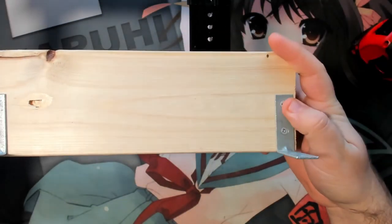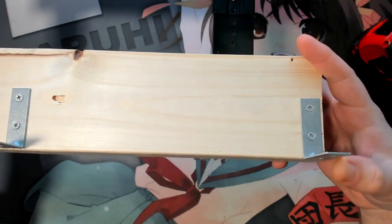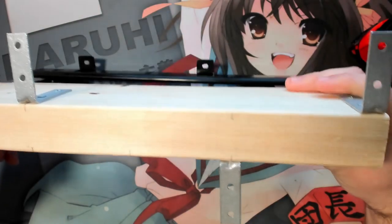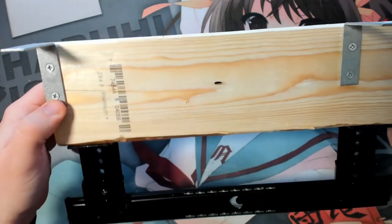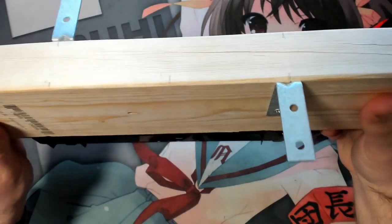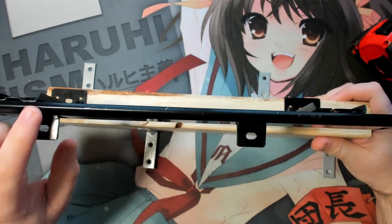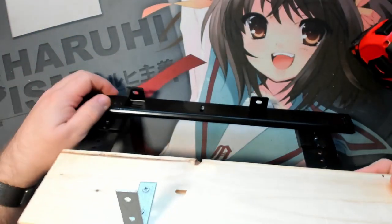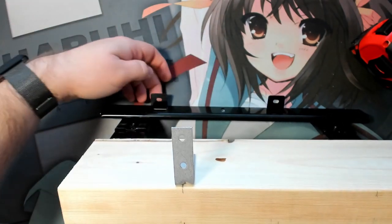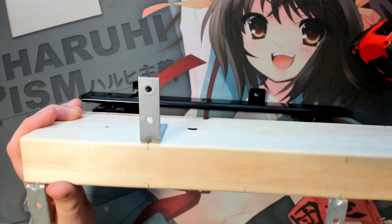The screws are three-quarter inch — they actually came with the brackets, which is really nice. I'll have a link to them from Home Depot in the description below. You stick two screws through each bracket to hold it underneath the table, then attach the shelf to the other side of the brackets. The shelf sits on these the same as the other one, and you screw from the underside in four places — that's how you hold the whole thing together.